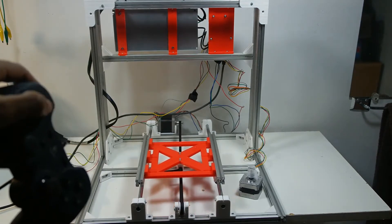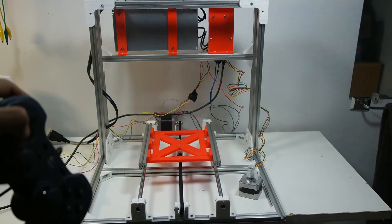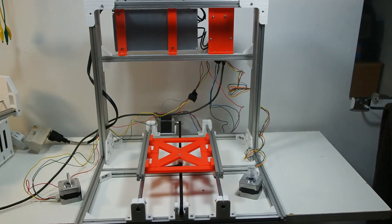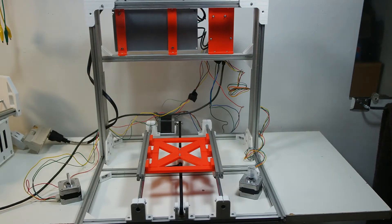It's moving in steps of 10 millimeters. The Y-axis so far has at least 220 millimeters of travel, maybe a little more — I have to do the testing. I'm going to design a 3D-printed clamp that mounts over this part, and from there I'll be able to mount double-sided PCB boards that you can buy. Then I'll be able to drill them and carve them as well.